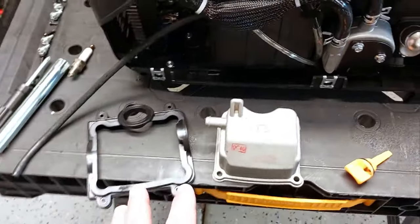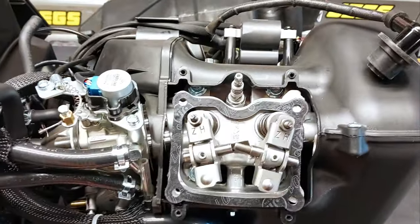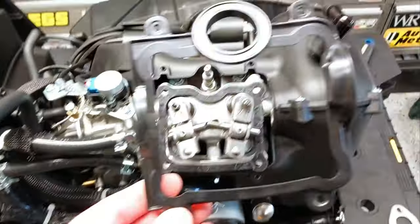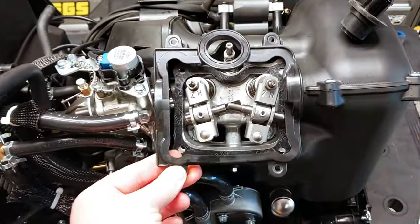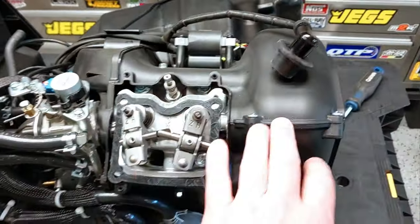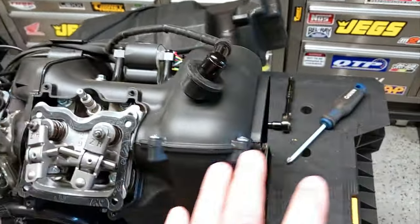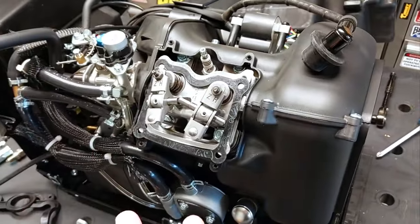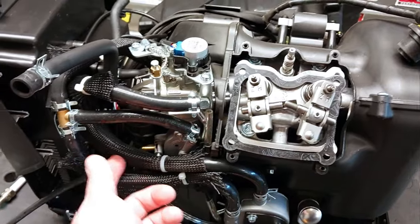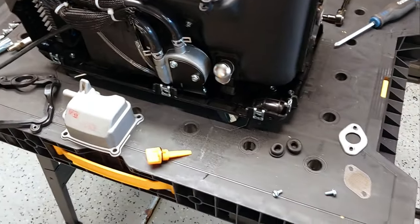But what's different about this Senci, normally the valve cover cap just goes on, and that's it. And there's a little bit of an air gap around it. No big deal. This one has this extra plastic guard that goes over the top of everything, and it completely seals up the case, so there's no hot air leakage anywhere. It completely forces all the hot air through the generating assembly and out the back. Just another nice little extra touch, along with things that show that they cared when they assembled it, like all these little chafe pads. That's just the right way to do it. I was kind of impressed with that.